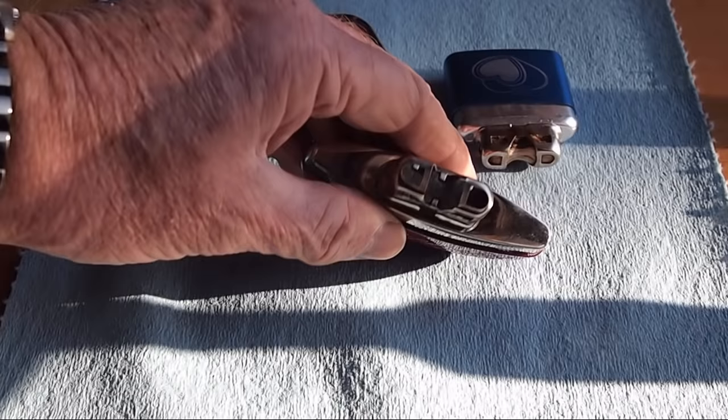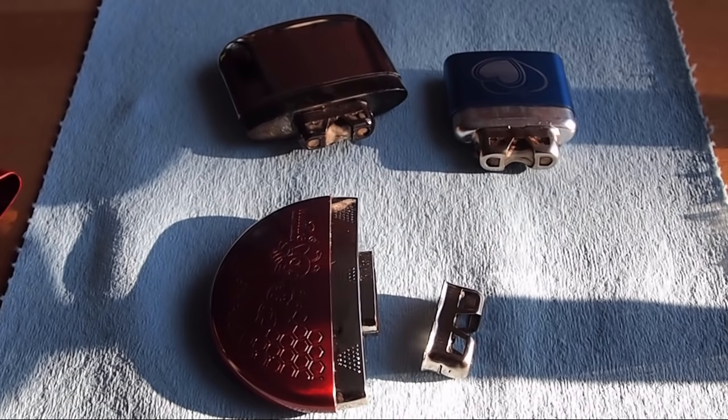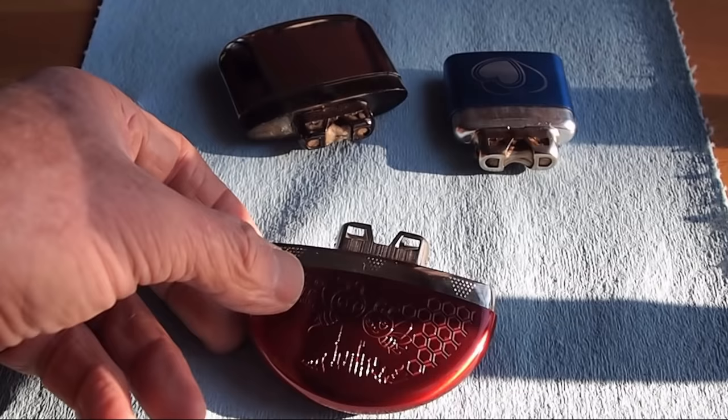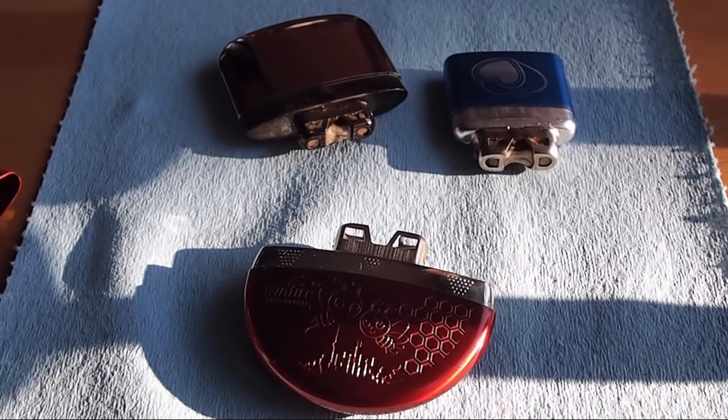The other thing that can be improved — whether it's a Zippo or a Chinese one — is that it's not a very good fit. What we'd like is a situation where we're not pulling the head off all the time, increasing our chances of damaging the catalyst material by bumping, prodding, or getting something caught in it. It would also be nice to increase heat transmission between the body and the head, so when the exothermic reaction is taking place it conducts heat down into the reservoir more efficiently, giving you more vapor and more heat.